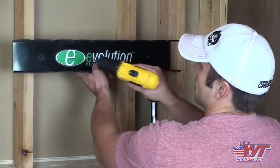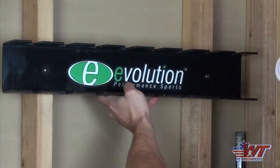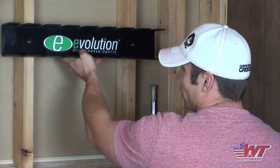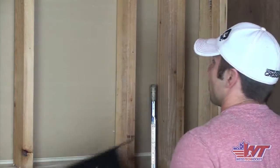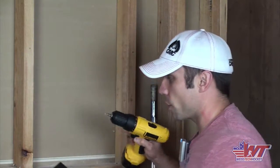So let's jump straight to the mounting process. You can mount it on drywall or straight onto the studs. It comes with all the hardware you need to go either way with that. One of the really cool design features is that these holes are spaced exactly as far apart as your studs would be, so it's really easy to mount. All you need to do is just get the right height that you want and make sure it's level, and then just basically drill the screws straight into the studs. I've already measured it and made sure it's level, got my holes marked, so we're just going to go straight forward with it.